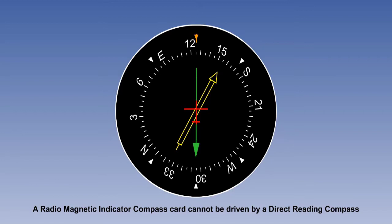Finally, it is a stand-alone system. The instrument is self-contained. It is not possible to take magnetic heading from it as an electrical or mechanical input into other equipment, such as those which display bearings from ground radio beacons, the autopilot, and the flight data recorder.